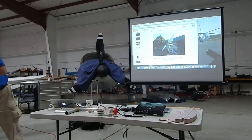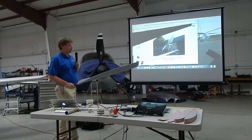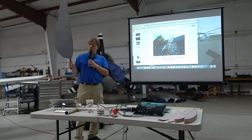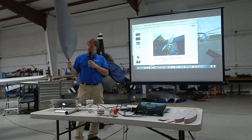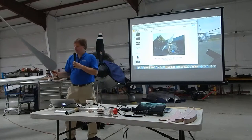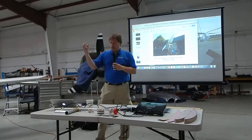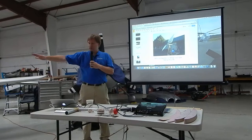This propeller blade — notice how wide and broad the chord is. It ended up being a lot heavier than we wanted. Each blade was about 750 grams and we were aiming for about 500 grams. So we changed the prop design by making the rotation speed faster, which brings the optimal chord size down a lot. We machined a little-bit-denser foam on a four-axis mill and then covered it with fiberglass, with the engineered spar with spar caps embedded inside. This is one of the actual prop blades from our successful flights. We tested them beforehand by loading them down with weights to simulate about a thousand-watt load, and they gain even more strength from the extra covering on the outside.